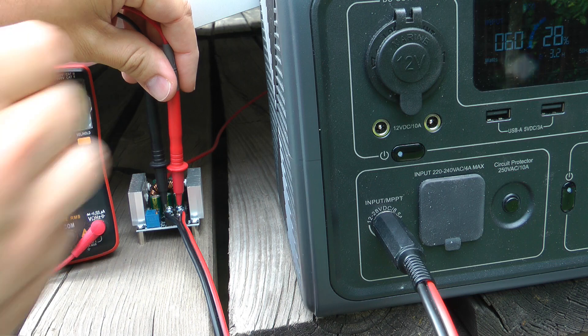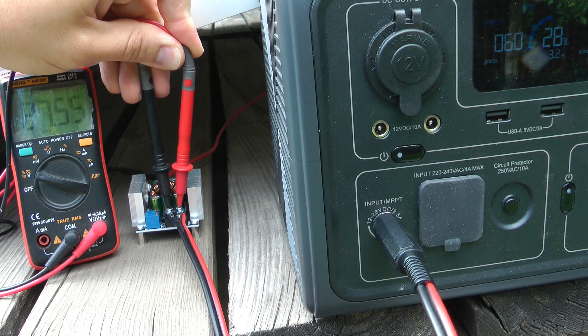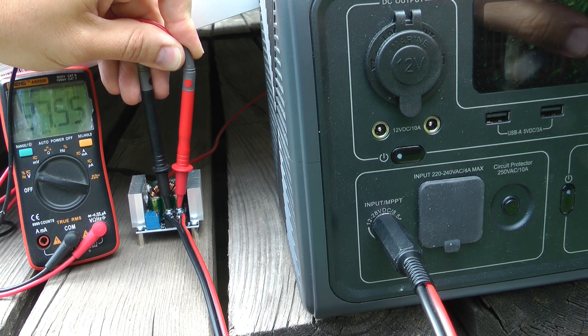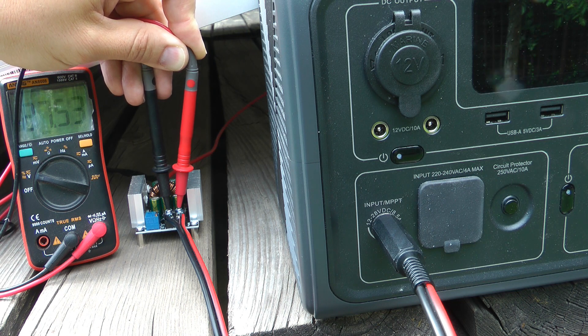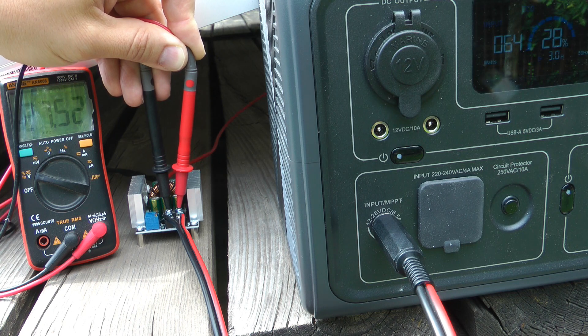Now measuring on the output side of the DC to DC converter, it reads 27 volts — the maximum — and charging at 60 watts under overcast conditions. Ideally I'd like to get another Bluetti EB3A and a 200 watt solar panel to test side by side, to see how much extra power the bigger panel with the DC-DC converter provides. I'm guessing there's a significant increase in charge rate. If you need power fast, a bigger solar panel ramps up charge power quicker, and in poor light conditions you'll definitely get more power even accounting for the converter losses.